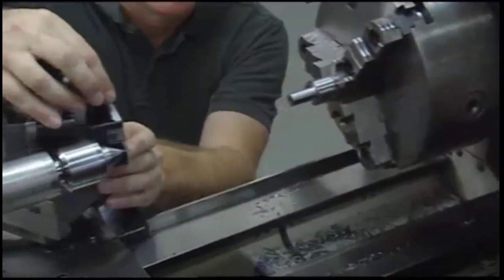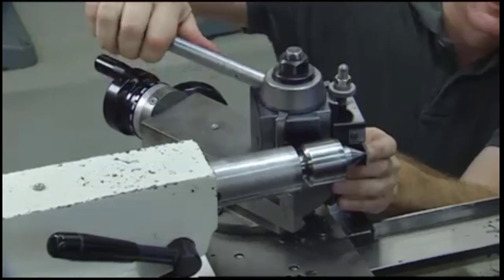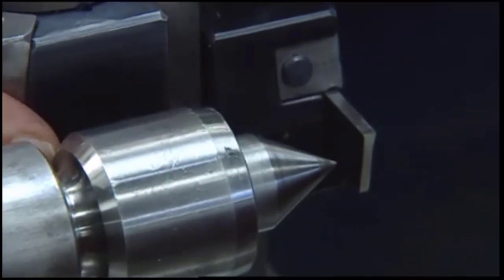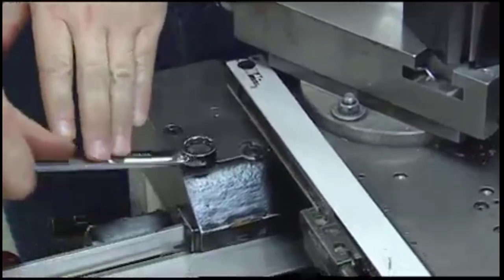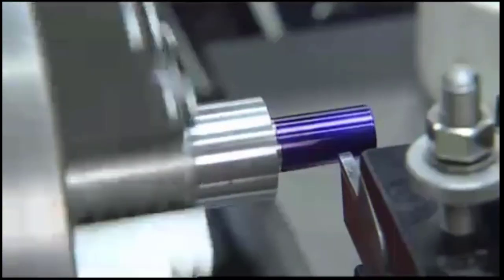The first step in machining a groove on a lathe is making sure that the height of the tool tip is on center, and that the grooving tool is parallel to the cross slide. To begin, locate the tool at the desired longitudinal location, and lock the carriage to the ways. Then set a spindle speed about 1/4 to 1/3 of normal turning speed.